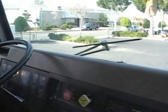I'm going to make sure there's no unauthorized stickers or decals that would obstruct my vision. No cracks larger than 2 inches. That thing's okay. It's not larger than 2 inches. I'm going to look at my wiper blades themselves. Make sure I've got a complete set. They're not cracked or damaged, and they appear to be mounted flush against the windshield itself.